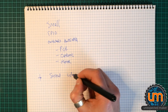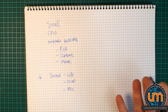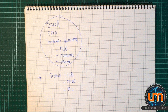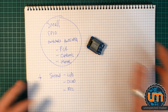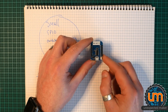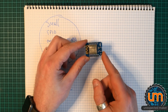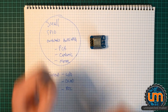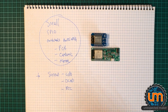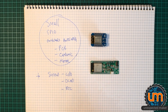We could do things like LiPo support, an OLED shield, or maybe a battery-backed RTC shield. We kept referencing this little guy — the Wemos D1 Mini, as many of you will know. It's an 8266 board. The idea was to beat this in size. Now that's pretty small — if you consider that an ESP32 module is almost as big as a Wemos D1 Mini all by itself, we weren't going to use the WROOM32 module.